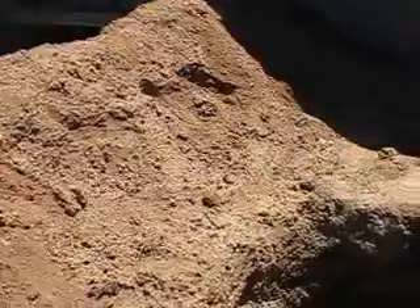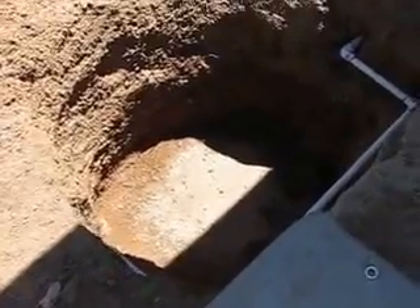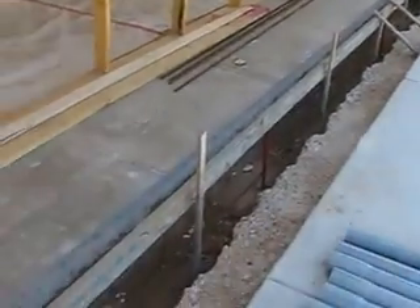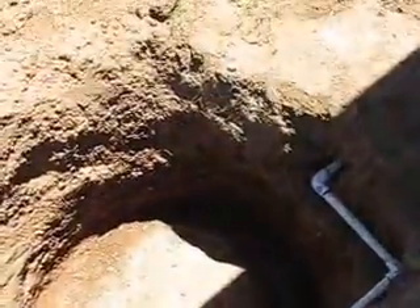What I want to show you here is a hole where your overflow reservoir will go. This is a pretty good sized hole — it's looking like it's approaching four foot deep. That will be where the water will drain from your 16 foot wide glass sliding door that will go in this area. It'll have a pipe underneath that will hook into it and it'll drain down into the ground from there. There's a reservoir we put in there and then river rock underneath it and all around it. It's going to be a great thing.